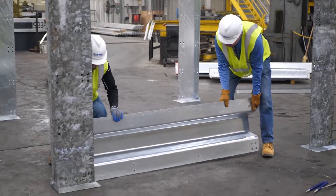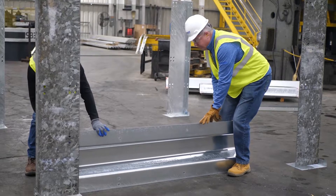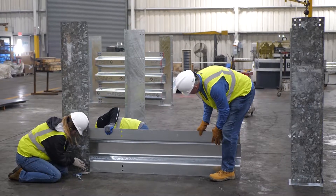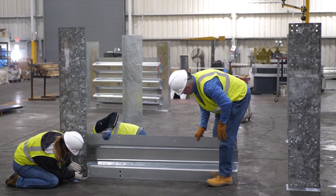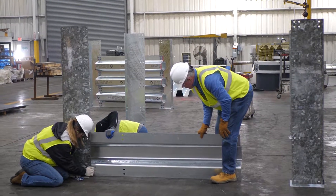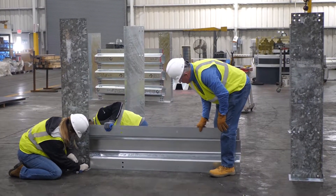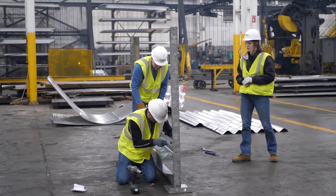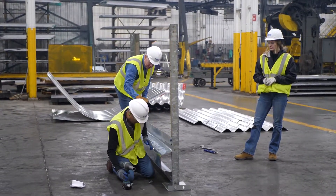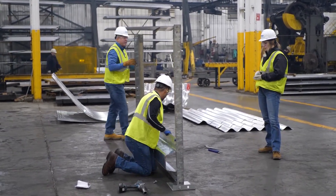Some terminology: Panel sections are the front and back of the bin wall — generally the stringers — and unless specifically customized, wall sections are 10 feet long. Transverse sections consist of the spacers and their connection to the vertical connectors; this is what holds the front and back panel sections together. The length of the spacers is based on the particular design depth. Today we are assembling Design B, which has an overall front-to-back dimension of 7.7 feet and a spacer length of 7 feet.